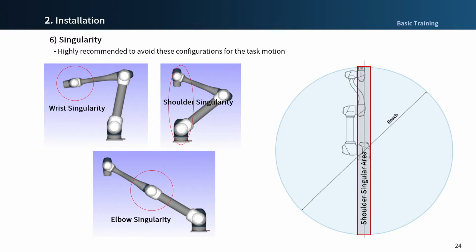If the robot joints are straightened out, a singularity occurs. Near the singularity area, the robot motion corresponds to a plane, point, or a straight line, making it difficult to move smoothly. And it also gets in trouble to move straight at the end of the robot and increases positional error during control. This occurs only in linear motion, and for the rotational movement such as joint motion, the singularity does not affect.